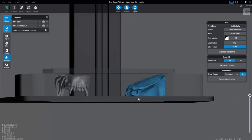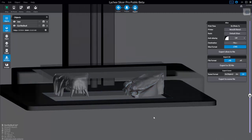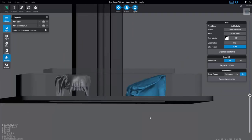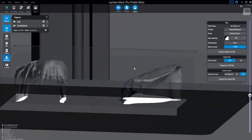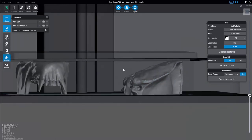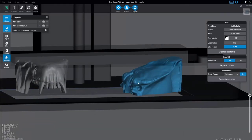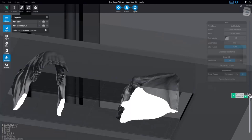Obviously, this is gonna get heavy, and as it's peeling off that build, that FEP plastic, it's gonna be pulling. And as it's doing that, you need supports out here to support all of this mass hanging straight down. And again, as we add supports, this will be more obvious, but you need supports in here to help pull all this plastic as it's sticking every couple seconds, or every time it goes down to the next layer, especially when you get to things like this.